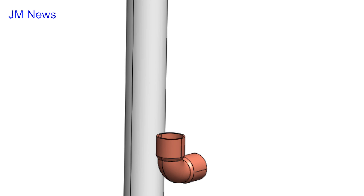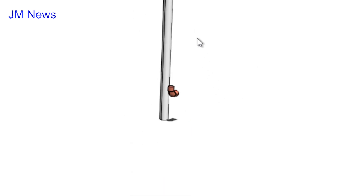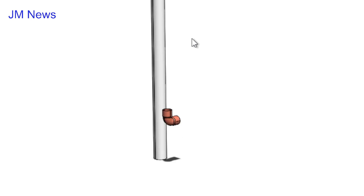The copper pipe — the blue portion of the skeleton slot antenna — is the equivalent of the solid plane in a classical slot antenna, with the vertical space between the loops forming the slot.